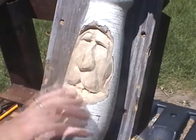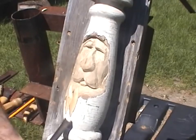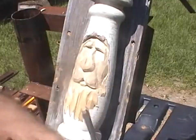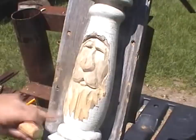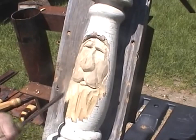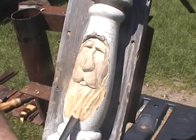I did a lot of carving on this with my knife — wouldn't want to do this project nowadays, we have other things now. Here I'm going right through the paint to get wood out and start forming a beard with a big gouge. These are Flex Cut gouges used with a mallet. I run big deep gouge marks in, taking the paint off as I go. Once I get into that really nice wood that peels right off, I come back, smooth it out, and make sure I've got nice ridges to run a V-tool through to make some neat hair.